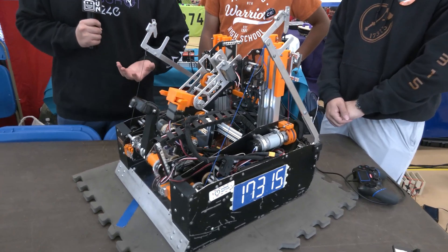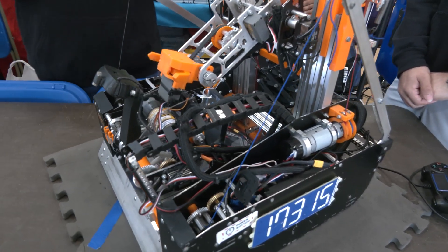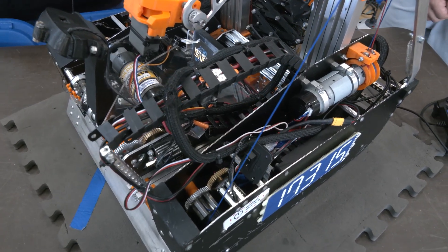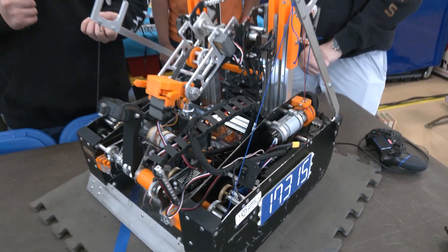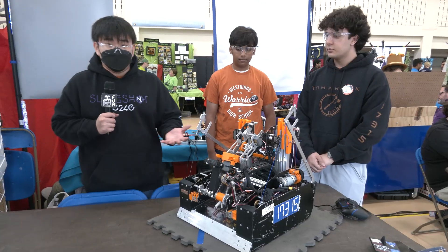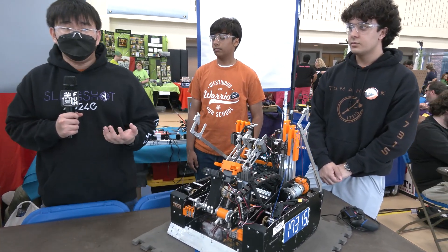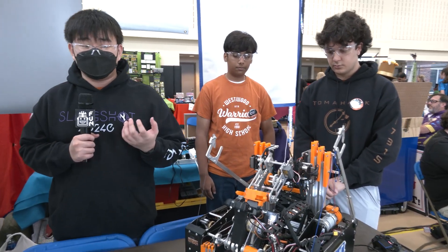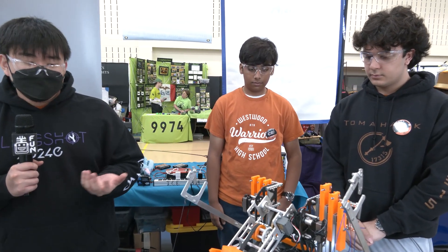The third thing I'd like to talk about is our heavily FSM-based autonomous and teleop. Our entire robot runs on a singular finite state machine referenced throughout both autonomous and teleop. During autonomous, the FSM is very helpful — when we miss a sample, instead of trying to score a sample we never picked up, we skip to the next state. We create redundancy in the states, which reduces errors, creates more reliability, and gives us extra time even if there is a failure during autonomous.